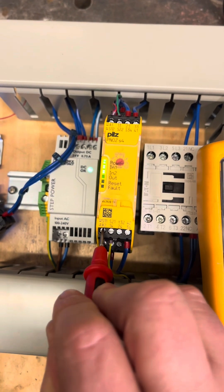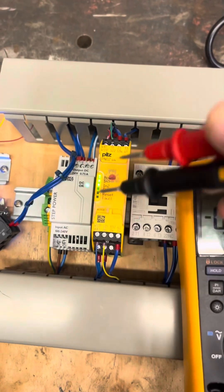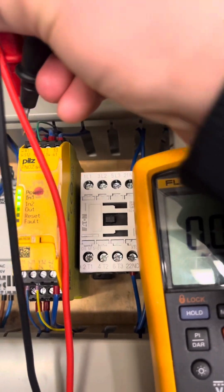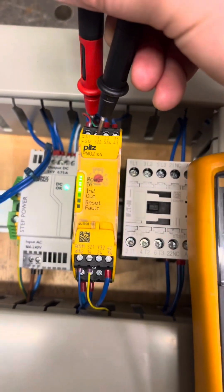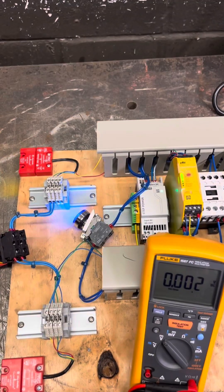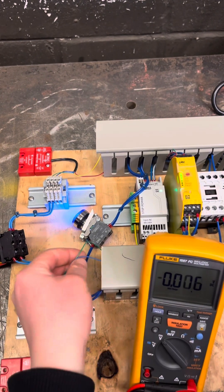With these Pilz relays specifically, you don't want to get caught out. You've got your plus and your minus voltage. If I go across with my negative lead still on A2, I've got nothing on channel two. This is what I meant — you want to be going plus to your A1. With my positive lead on A1, you can now see that — that's what I mean by the negative voltage on that channel. That's how it does the short circuit protection. So make sure all your door switches are made first.